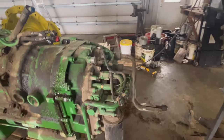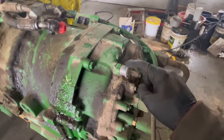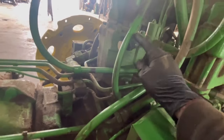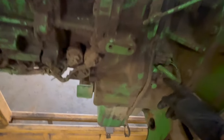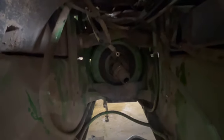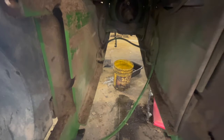There are two more lines to take off after you get this thing split. Because it's so tight, you can't actually see the top one until you get it split away a couple of inches. Then after you get it out about a foot or two, there's a line up here that comes off and attaches via a hose clamp to that bolt right there — you can't get to that bolt until you're split apart a couple of feet. The drive shaft up there just slides off the shaft and doesn't have to be disconnected. We also had to take off this pipe right here because it was hitting on this — it has to come off later anyway, so we just did it now.